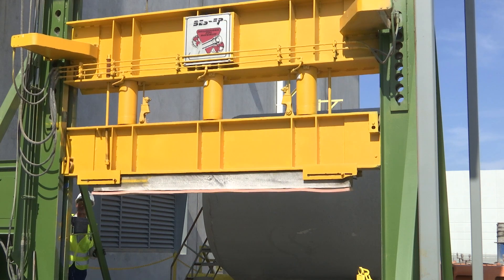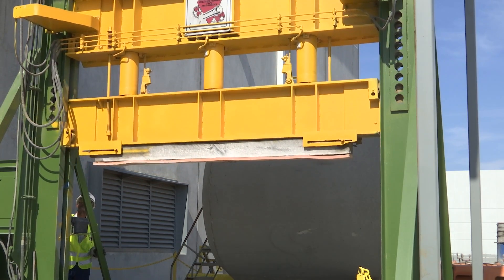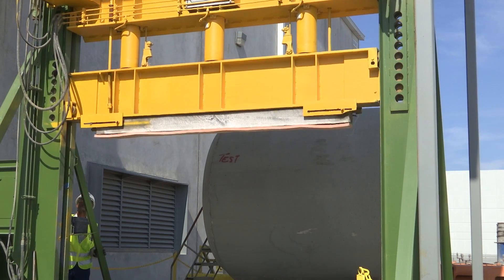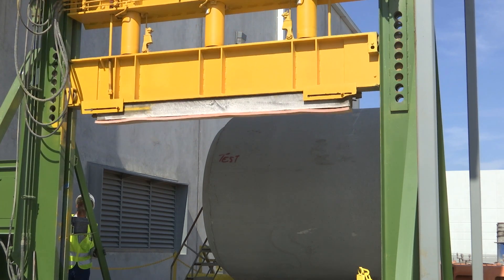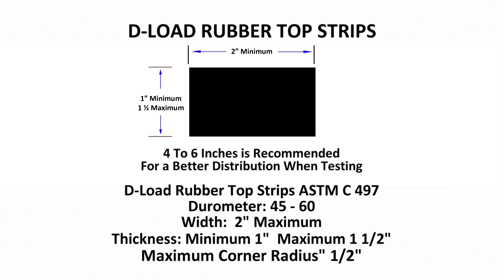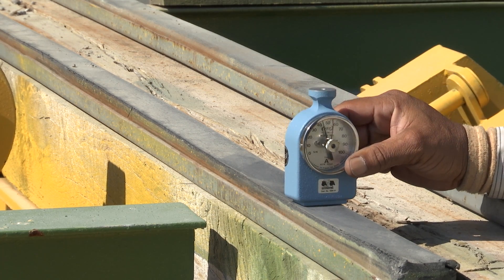The upper beam should be a solid wood beam that is straight and true. Just one beam shall be used, not multiple timbers or boards. The upper bearing does not require a rubber strip. However, if a rubber strip is used, it must be attached to the upper beam. Rinker Materials recommends using top strips that are 4 inches to 6 inches wide for a better distribution when testing. The rubber strip should be between 45 to 60 durometer.